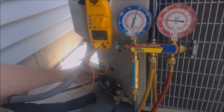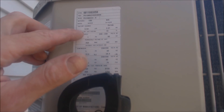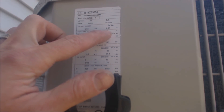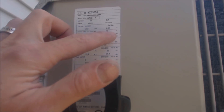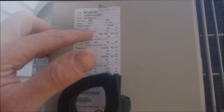This is out of the sun and within a few inches of where you're taking your liquid pressure reading. We're going to go ahead and turn this unit on. This says R410A, and it says indoor TXV sub-cooling 10 degrees. We confirmed that there is actually a TXV metering device on the inside. Just because this is on the rating plate does not mean that you're going to check the charge in sub-cooling — it's only if you have a thermostatic expansion valve.